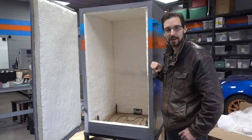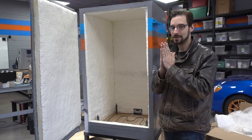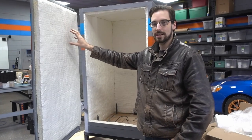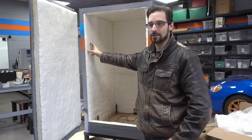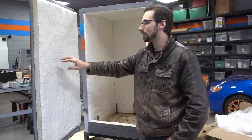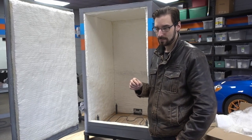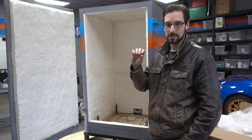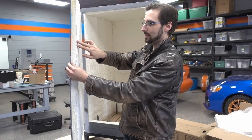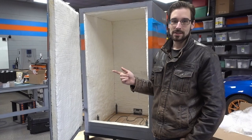Everything went unusually smoothly — I was quite surprised. That adhesive works really well. Once you spray it on both sides, let it wait for a minute, and stick them together, they really don't want to come apart. When you put the rigidizer on, it's not so much that it becomes hard, but it's like a crusty outside with a marshmallow-y center, which is actually really good for this design. When I close the door, I was hoping that the insulation would compress against each other and form somewhat of a seal. My concern was that maybe it was going to be too hard and would crack or scrape, but it looks like it'll compress and move a little bit — it's just a little bit crusty on the outside. So that'll probably work pretty well, and we'll just have to watch it long term.